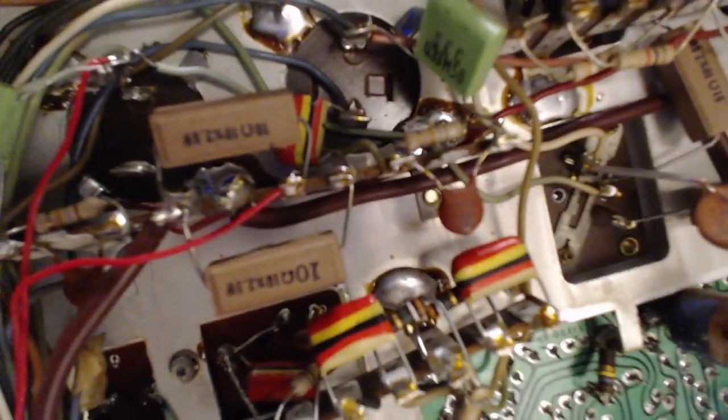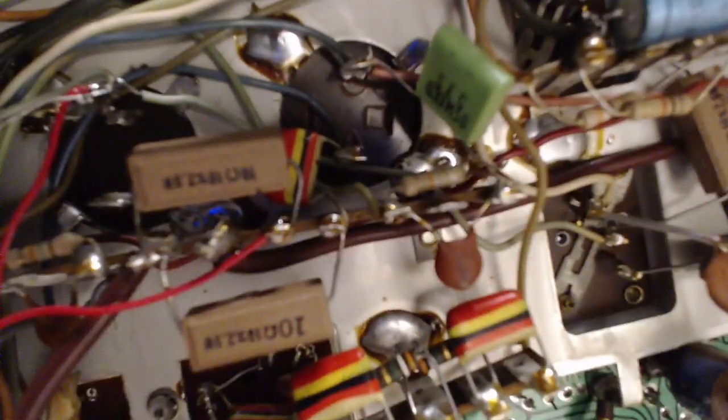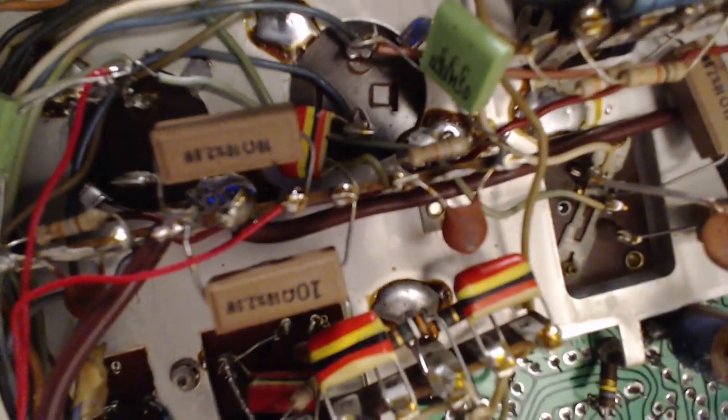Oh, that was the light getting readjusted. So I see a triangle, I see a half moon, I see a square with a blank. Nothing there. So this must be can grounded. You can see some solder up at the top there, so they've soldered the can. The can's the negative. And two terminals there, so half moon or triangle. Which one is it?